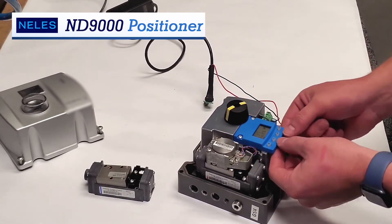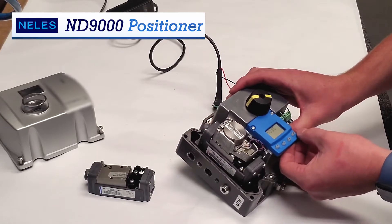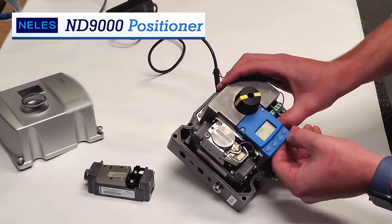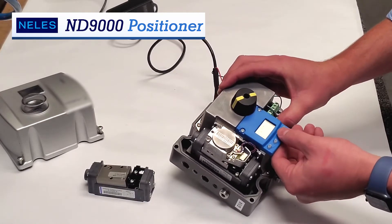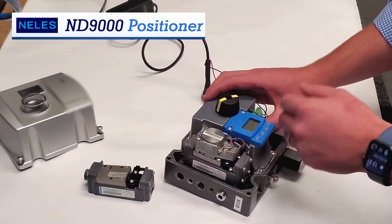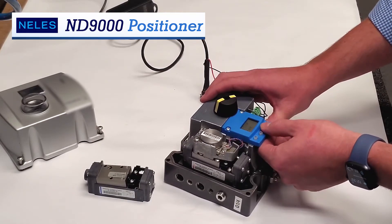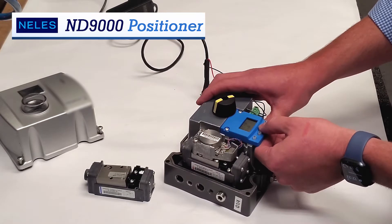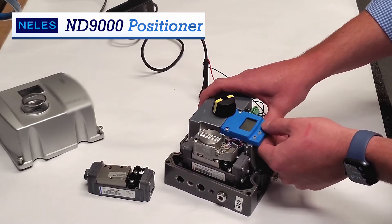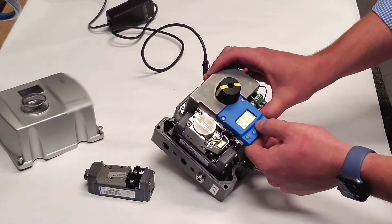To get into some of the more key features of it, we hold down the plus and minus keys and we're going to get into the mode here. There's an auto and a manual mode. To get into it, click enter, and you can change it from auto to manual. We're going to go with auto. Then you can get into the parameters. Some of the parameters might include the type of performance, A through E, where A is more aggressive and E is less aggressive to get a slower opening but more precise control. Cut off, if you want to fail open or closed. Valve type — this can be put on a rotary or linear style valve, a single or double acting actuator. Position or fail action upon loss of signal. Rotation, if it's counter clockwise or clockwise to open. Dead angle. And what type of communication it's set up for — this one's set up for HART.